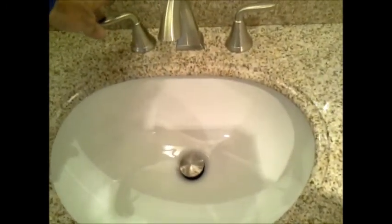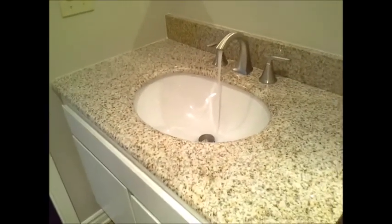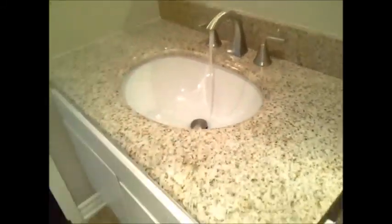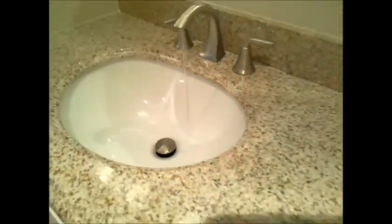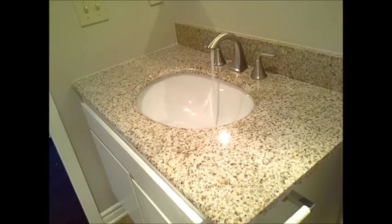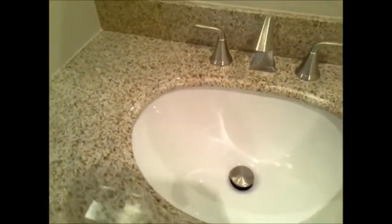So we're talking about the galvanized pipes, and one of the problems with galvanized. The inside of the galvanized usually builds up with a lot of minerals. So one of the tests we do is a flow test. We'll turn the sink on and reach over to the tub. You can see how much that is found to drip now. So it's sort of like my arteries. It's cholesterol buildup, and we'll turn it back on. And the water comes back. So basically, at this point, the house needs to be repiped with copper, or any of the other newer pipes. We use PEX or CPVC.